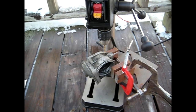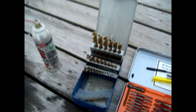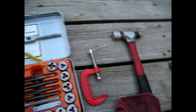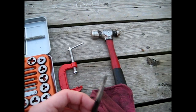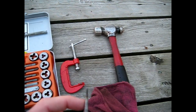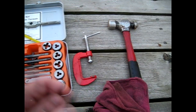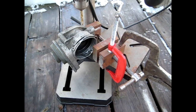The tools you basically need for the job are a drill or drill press — a drill press does make the job a lot easier. You're going to need a drill set, a tap set, and optionally a hammer and a center punch. The center punch creates an indentation in the material, which keeps the drill bit on center and prevents it from wandering. You're also going to need some way to clamp your workpiece down to prevent any accidents.